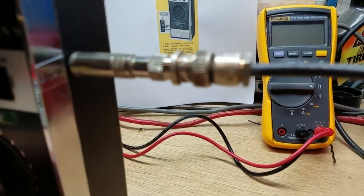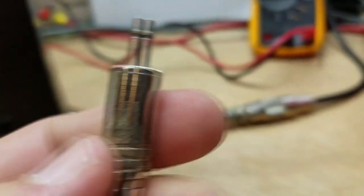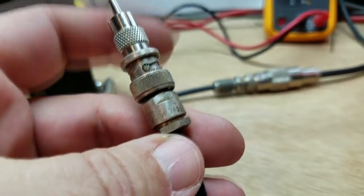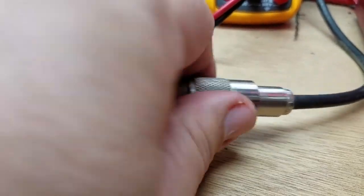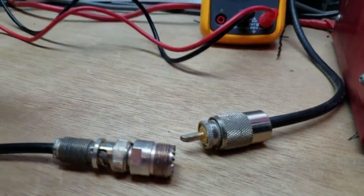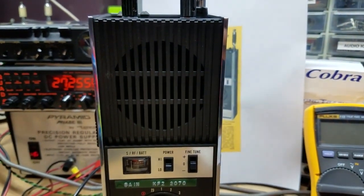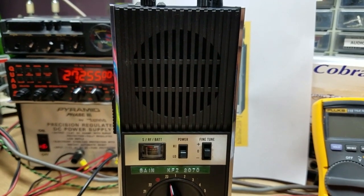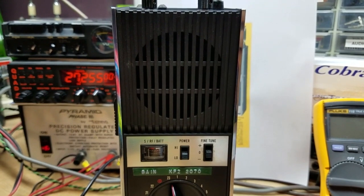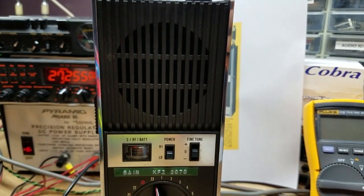Now, I'm not really sure this is a very scientific power measurement here. I am going through the earphone jack into an RCA, into a BNC, an unmarked unknown patch cord, to a BNC, to a 259 converter, and into 3 feet of patch cord going into the Bird meter. So I don't know — could be a little loss there. But relatively, it does put out power. I have stood out in my backyard and talked a little over 8 miles, possibly 8½ miles, to the east of me. And I have made it into town to the west of me, and that was around 9 miles, standing out in my backyard talking to a base station.